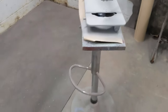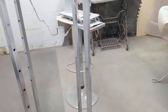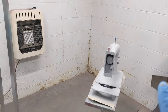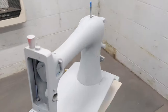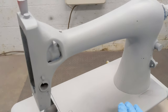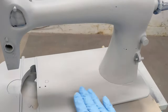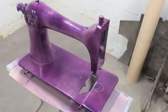I've been shaking up my can of paint and I've got my timer going — about another four and a half minutes. I give myself around 10 minutes, which is very long for a primer, but then I come in with a clean microfiber cloth and give it a wipe. That's enough to smooth down any roughness in the texture of the primer itself. We're not trying to get out every little imperfection because it's an old iron machine, but it's going to smooth down the paint so that when I come back with my color coat it'll lay a lot smoother.